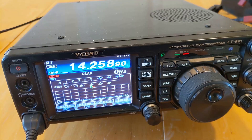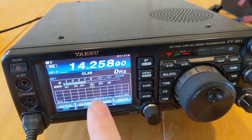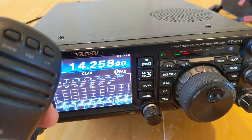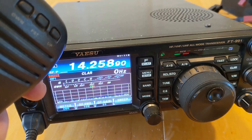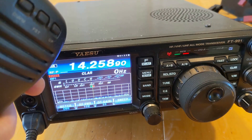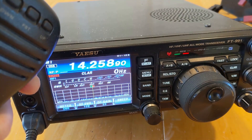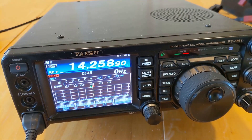We're all buttoned up. This is the moment of truth, guys — let's see if we can tune up on this thing. We're on 20 meters. Turn the volume down a little bit, let's press tune. It's trying to tune. It has a tuning solution now. The real test is can we talk into it with no SWR — we don't want to see any line pop up here. This is KM6LYW radio testing, and I don't see any SWR. In fact, SWR is not even registering at all. We did it — we fixed an antenna tuner on a Yaesu 991.